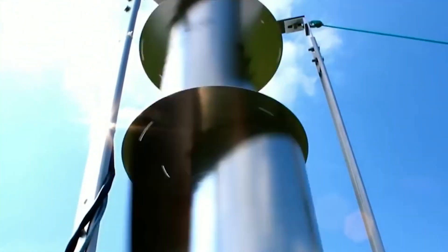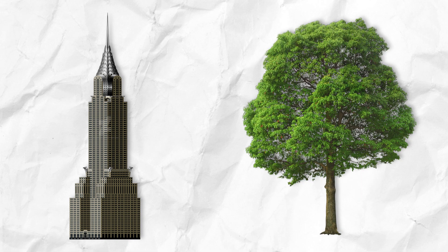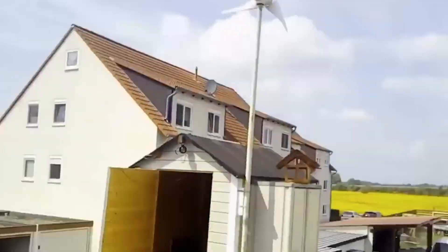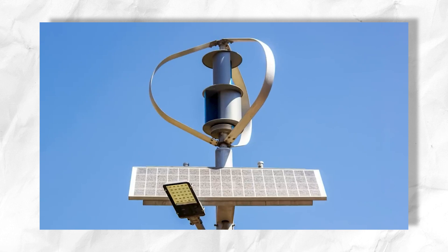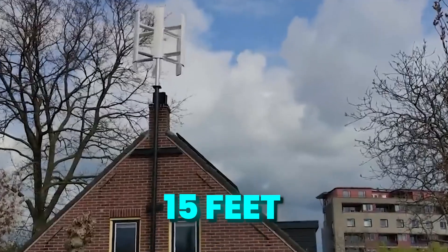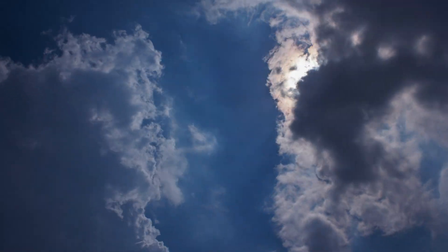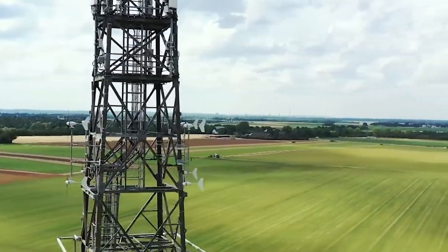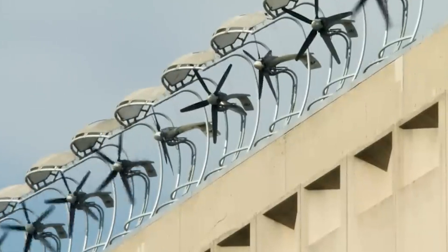Choosing the optimal location is critical when installing a residential wind turbine. An elevation clear of obstructions like buildings or trees allows full access to prevailing winds, greatly boosting potential power output. This homeowner was fortunate to have a large 0.4-acre suburban property with minimal barriers, featuring a small grassy knoll rising approximately 15 feet over the surrounding terrain. After analyzing historical weather patterns and running computational fluid dynamics simulations, the knoll was selected for its smooth laminar wind flow and sufficient wind speeds averaging 12 to 15 miles per hour from the prevailing southwesterly direction.